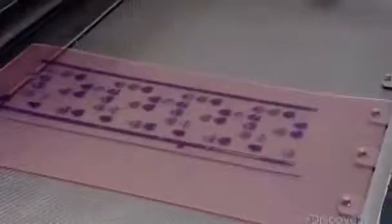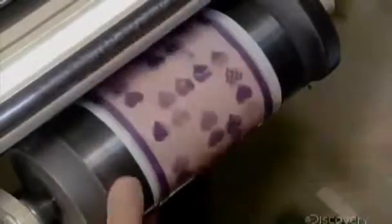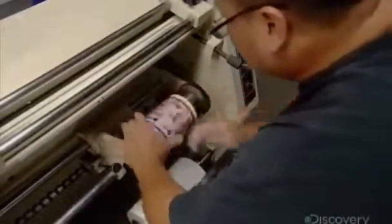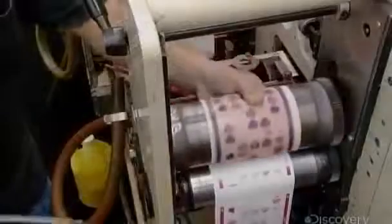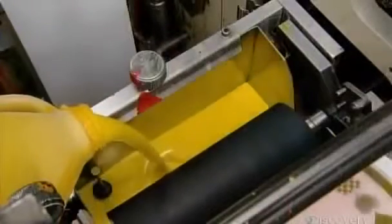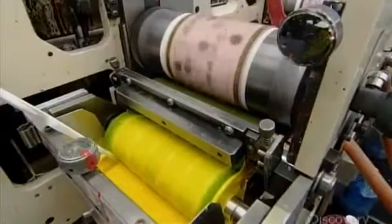The process leaves the images slightly raised against a clear backdrop and ready for the printing press. They wrap the printing plates around cylinders, and the press operator examines the seam under a magnifying glass to confirm that the edges are perfectly aligned. He loads the cylinder into the printing press, then pours yellow ink into a reservoir below, and it's time to roll. Rollers transfer the ink to the printing cylinder, and it prints the art onto adhesive-backed sticker paper.